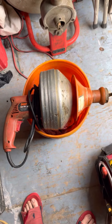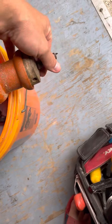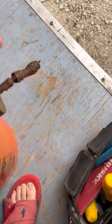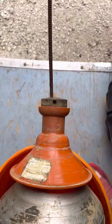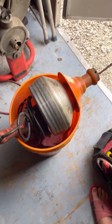Pipe size: inch and a quarter, inch and a half — absolutely perfect on that. I got a whole drop-in bulb on there. It's got a whole cable on the inside of that thing that just pulls right out. The style that I use is quarter inch by 25 feet — drop-head cable, about $50, give or take a little bit.